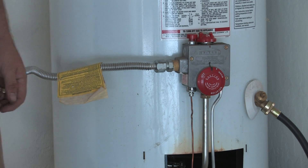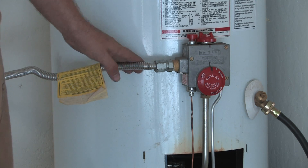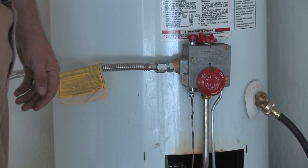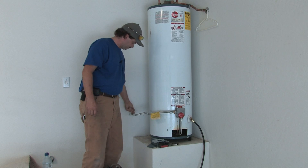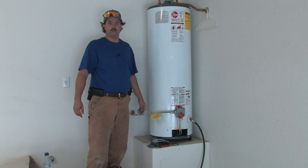It's a good idea to always double-check yourself with soap bubbles when you're done, just to make sure you have no gas leaks at all. If you do find a leak, shut your gas back off and call your certified technician. To finish up, you turn the gas on and you're ready to light your pilot light. You have your doors off, so it's time to light the pilot light.